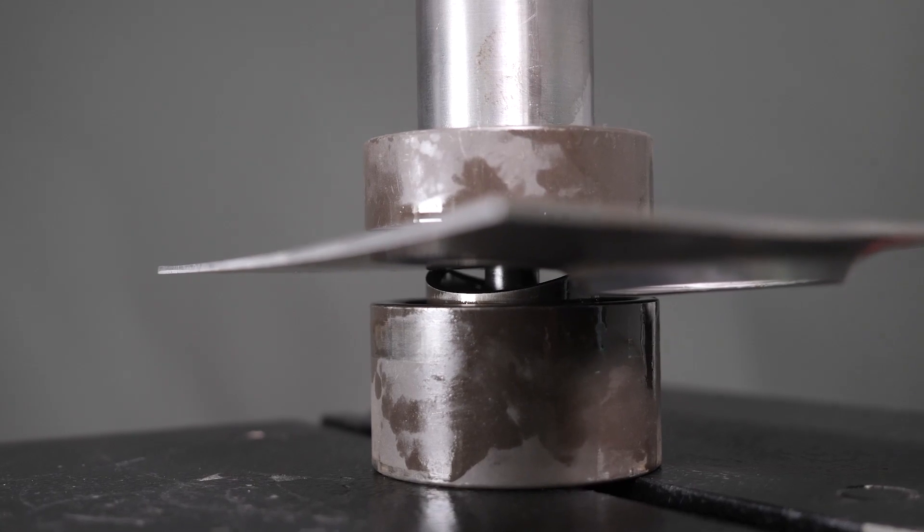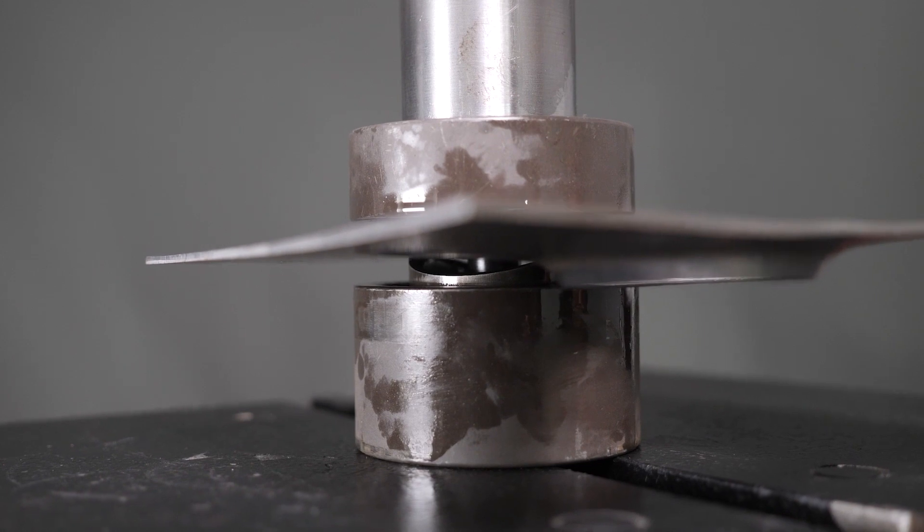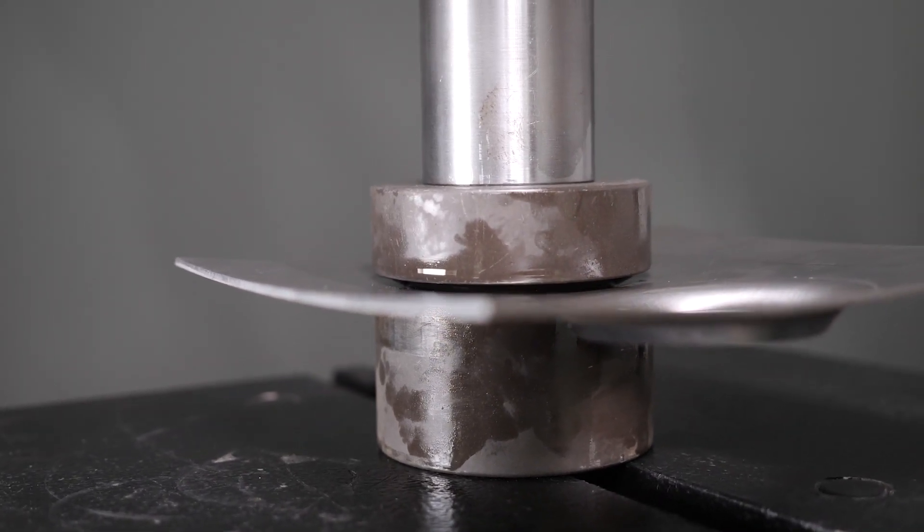For this reason, we're actually going to use our press instead. This requires a sleeve to be placed between the die and the press so that the die can be compressed without the press contacting the bolt. Alternatively, you can purchase a hydraulic version of the punch and flare tool for a little more outlay. Just like the dimple die, we know the task is complete when the work piece becomes flat and the resistance on the press increases. If you're intending to dimple die a series of holes, it's important to work out the centre spacing first to allow clearance between the flares fouling on the dimple die that will be pressed next to it.